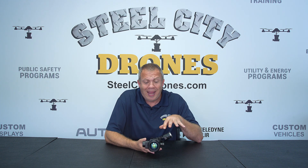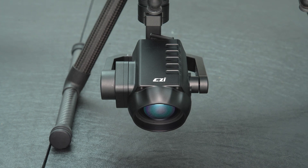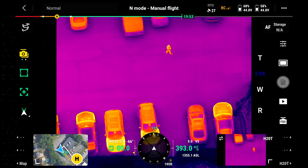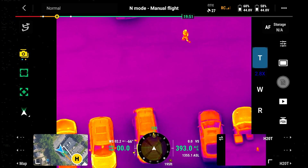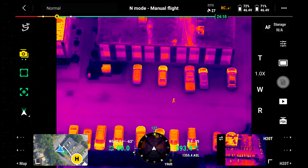This camera is very light — only 740 grams. Because it's only a thermal camera, it's going to be much less than its C30N counterpart. The effective focal range on this camera is 121 millimeters. When we pair that with an HD sensor, we're going to be able to get really clear definition even when zooming in digitally. So there are a lot of advantages: it's lighter, we get more flight time, and we can fly safer with a lot more resolution at higher altitudes.